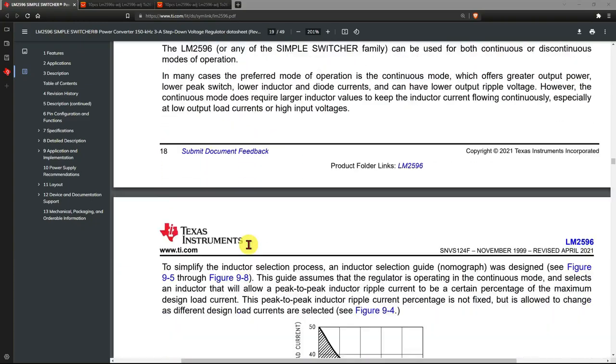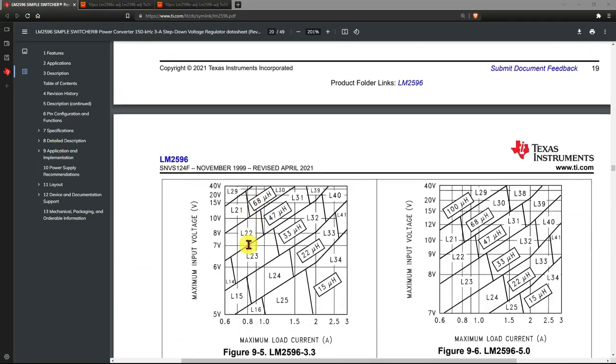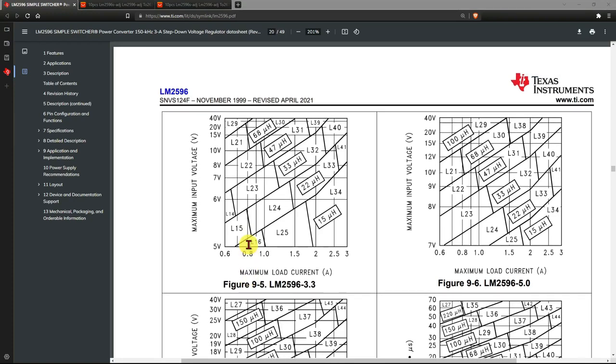So, lots of discussion about this ESR thing. Obviously the capacitors are very important. They have to be close to the chip. You have to make sure that the inductance, the magnetic field from the inductor, doesn't interfere with the feedback mechanism, traces, resistors, and so on. And the traces on the PCB have to be very large so that they don't have much resistance and so on. So that's the tricky bit of these